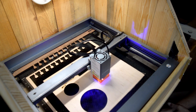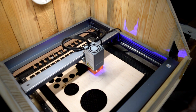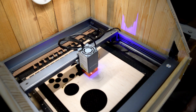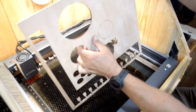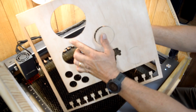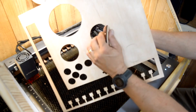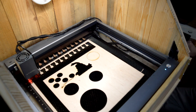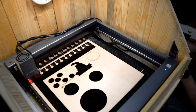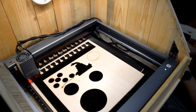I couldn't find a gauge that went any lower than this one does, so it's kind of finicky when setting pressures. I ordered this as a kit — it came with a regulator, the oiler which we did away with any oil, and connectors. That was without the air assist, and then with the same power setting, that's with the air assist. I got one little snag, but I'm running at 7 millimeters per second which is kind of a fast pace for cutting, so I'm going to slow to 6 mm/s and see if we can get a clean dropout.